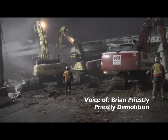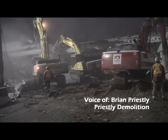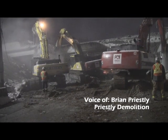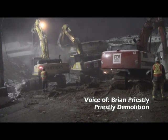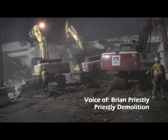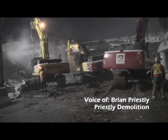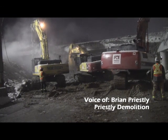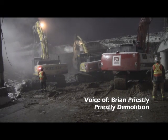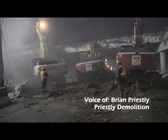Can you talk about some of the machines? Are they bigger than usual excavators, or specifically for this? Well, they're 50-ton excavators and they're set up specifically for demolition. They've been plumbed to take this type of attachment. You see the hammers — those are very quick to put on. You can use a bucket, a clam, or a hammer, which are all the typical tools in demolition. The shear is actually assembled onto the boom of the machine and then it stays on. It's a little more complicated to install, but we'll put it on for a long duration. It'll do the demolition and also help with processing the material to make it undersized so it can fit the trailers better and get better capacity — less loads at the end of the day.